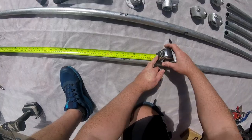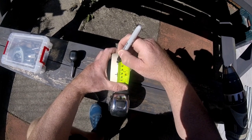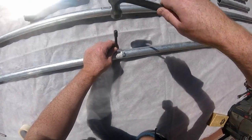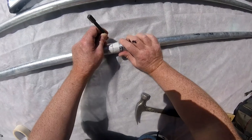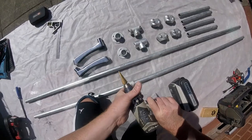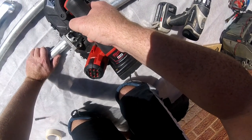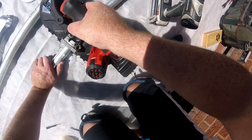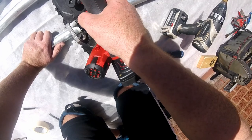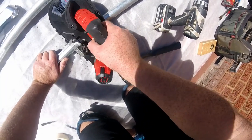Hiding the wires is a must for any clean workstation, so I marked out the holes on the tubing where I wanted them to go. I used masking tape to make sure the holes were 30 millimeters apart. I used a punch to mark the spot for the drill, piloted with a 4mm drill bit before going all the way with a multi-hole tool. I then used the bandsaw to cut out the material between the holes, leaving a 15 by 30 millimeter slot — the first one was slightly butchered but nothing a file couldn't fix.